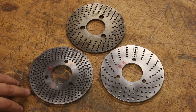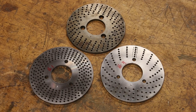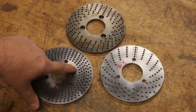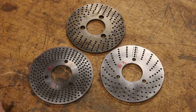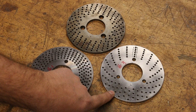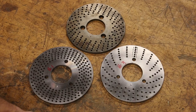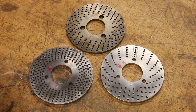Because you guys had so many questions on how would you do this manually, I'm going to take a little extra time and show you two different ways to put that hole pattern in there. The first way — like how I made my dividing plate many years ago — is setting this up on a rotary table, finding the center of the part, moving out the proper radius, and then using the rotary table to dial in the angles: 60 degrees between each hole. The second way is putting it in the vise on the mill and using my digital readout, which has a bolt hole function built in that will drive me to the individual coordinates to drill the holes.